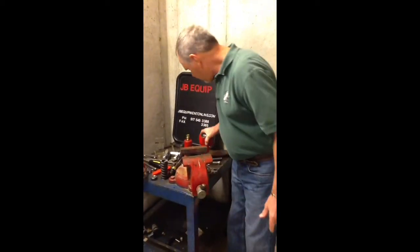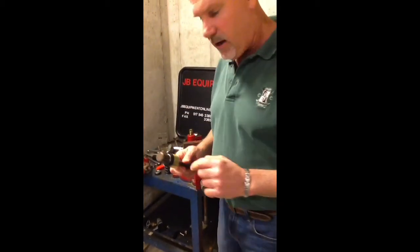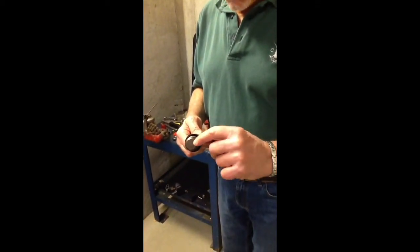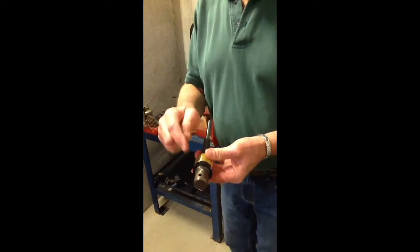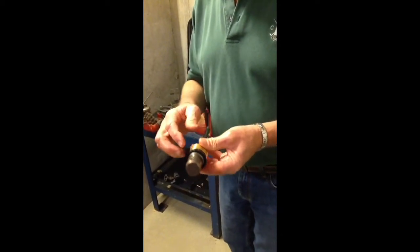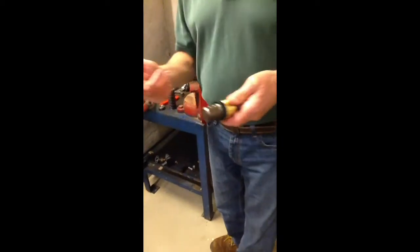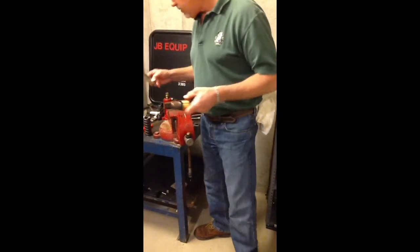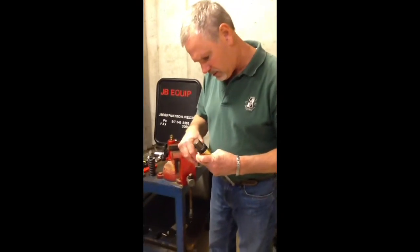Now, you can have erosion marks across the valve seat, and this is the valve assembly. You could have the same issue here — erosion marks or a blown packing cup. You want to either buy a new stem assembly or go ahead and disassemble this one, get new parts, and put them into it.